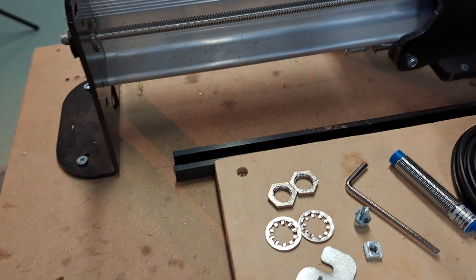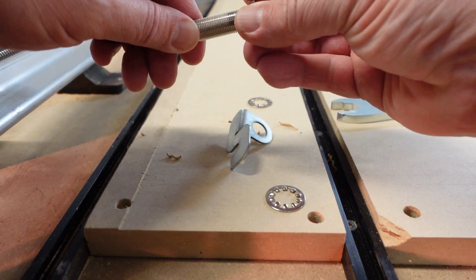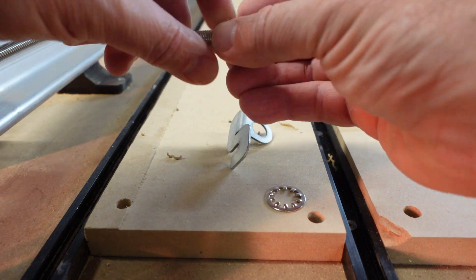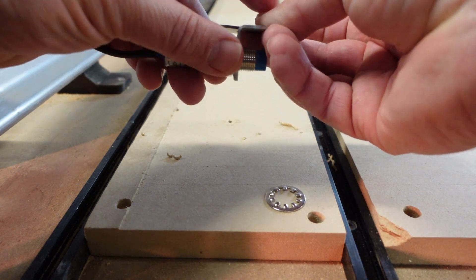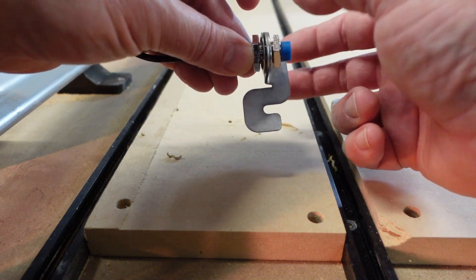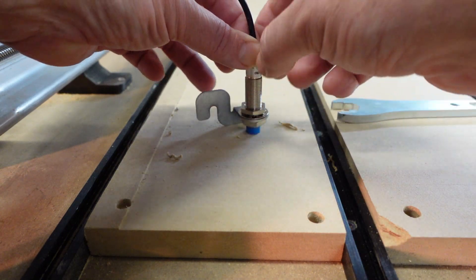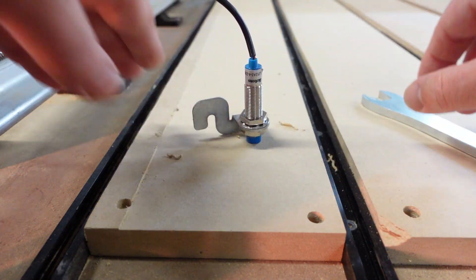Onto the Y-sensor — here are all the parts that you'll use. To make the installation a little easier, we're going to pre-install the sensor onto the sensor bracket. As with all our other installations, the nut goes on first, then a lock washer, and then we'll install it through the bracket. Orientation is important. The bracket has been cleverly designed to minimize setup — the sensor depth will be the same as the face of the bracket. Use the supplied wrench to tighten the nut, but not overly tight because you may need to make adjustments later.